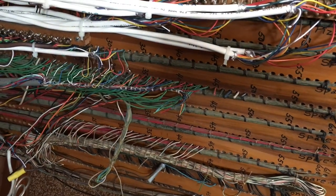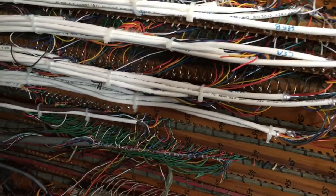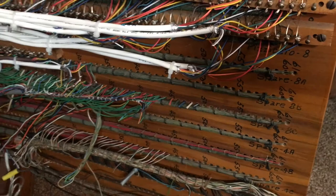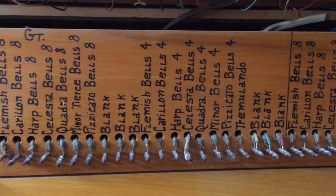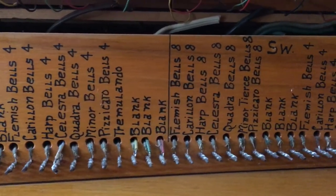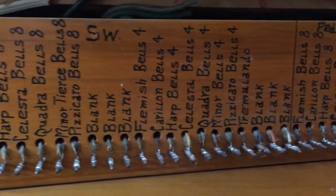In the back are the wires which lead out to the cabinets where the bells are housed, and also all those black wires we saw coming off the contact leaves terminate on this panel. Above it is a rail that has the connections for the stop action solenoids — again we see some of those unfamiliar names, probably experimental or abandoned bell types that didn't go into production. There are also a few control terminals toward the end of that panel.